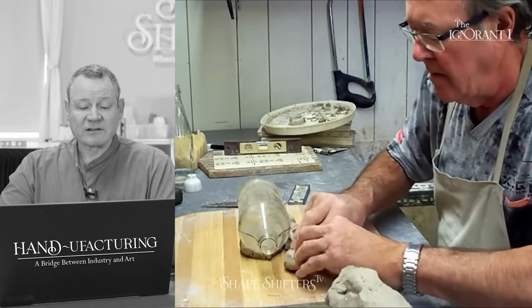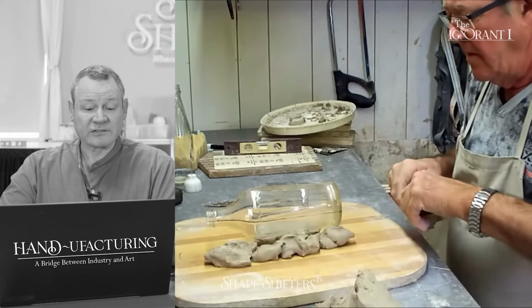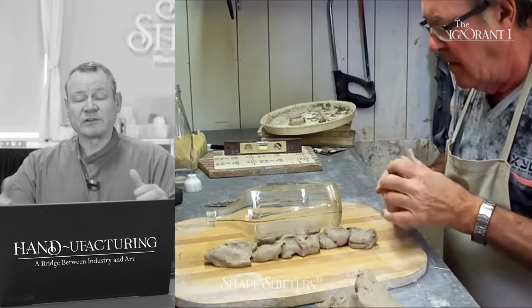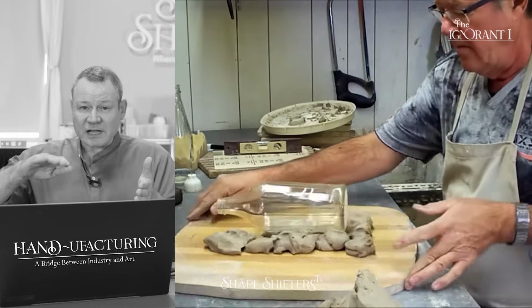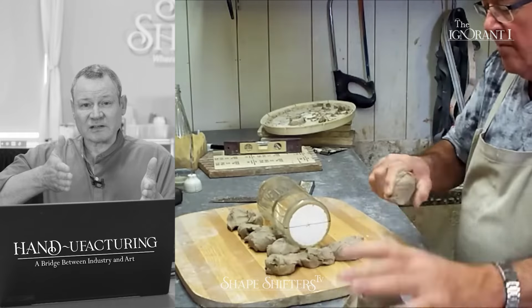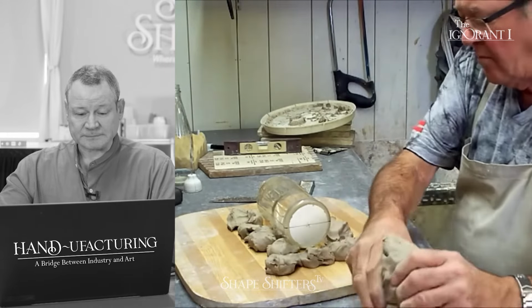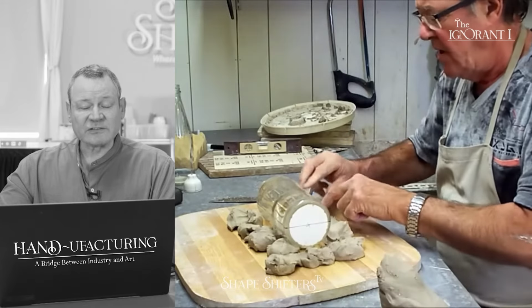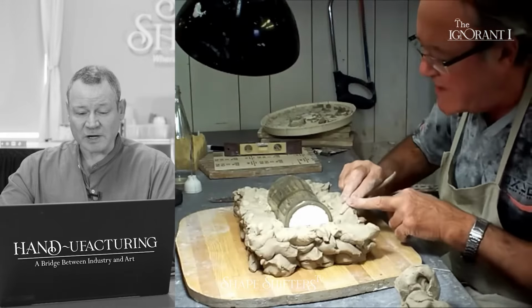When you're fast, one mold section like this will take you 1 hour to set up, or less. Some people will add too much clay, and they spend a lot of time leveling clay that they're going to cut away anyways. We've seen that in another video. This is really nice to work with water-based clay because oil-based clay is hard on the hands, even if you warm it up.